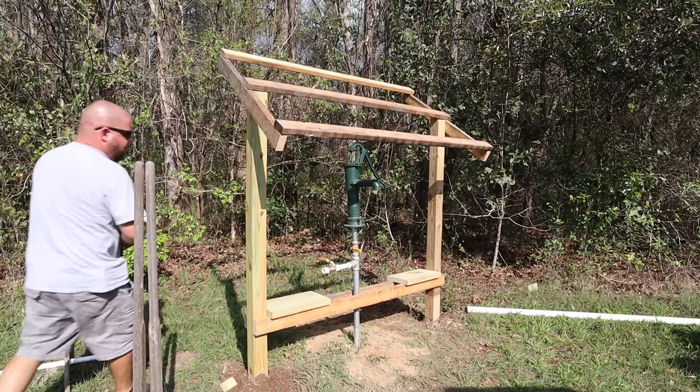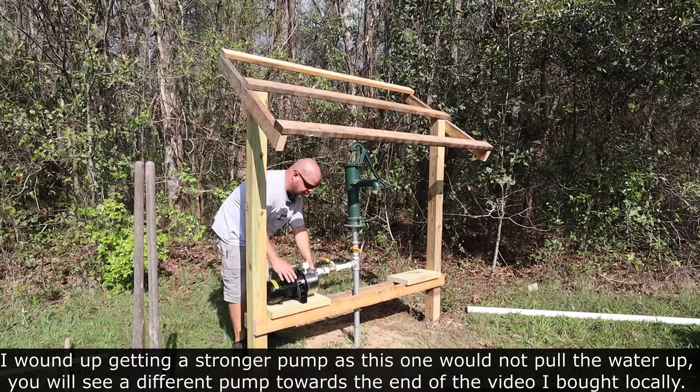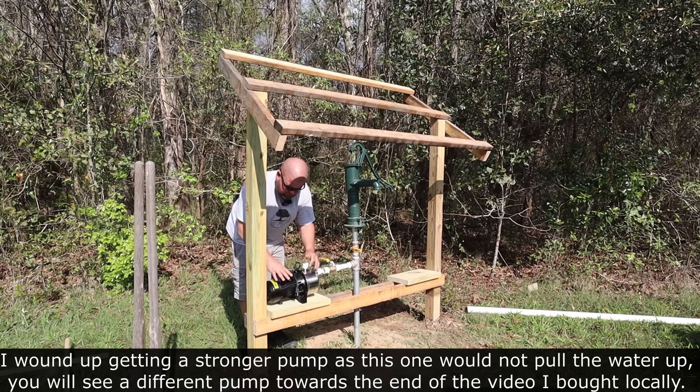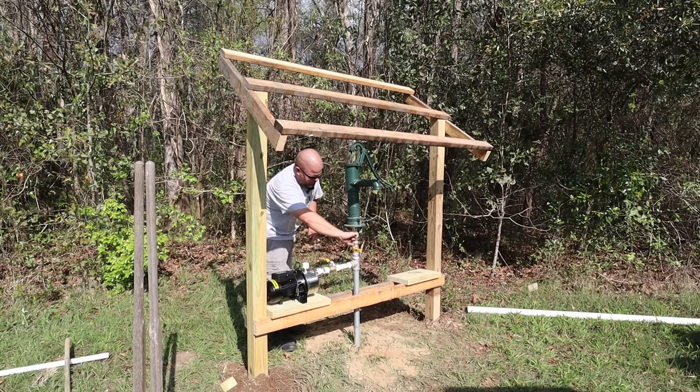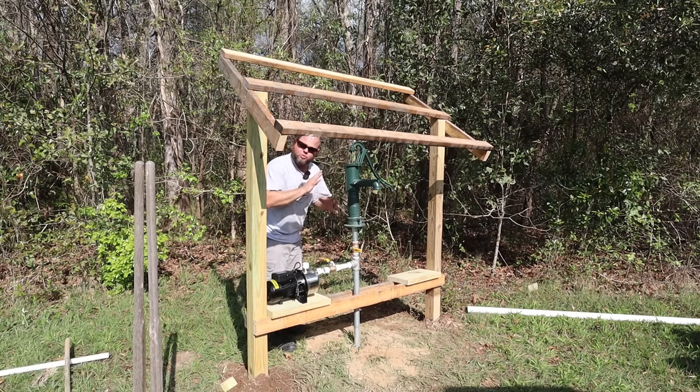It's time to get ready to install this pump so the glue and all can be setting up. I've got a pressure-treated platform right here made just for bolting in this pump, and we'll plumb everything together. I'm setting this up so I can open one valve to run the hand pump, close that, open the other, and use the electric pump. You can see I've got the roof pitched — we're going to put some solar panels up here at a degree that should work well year round.